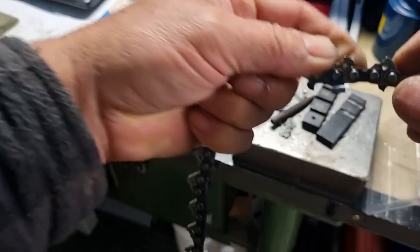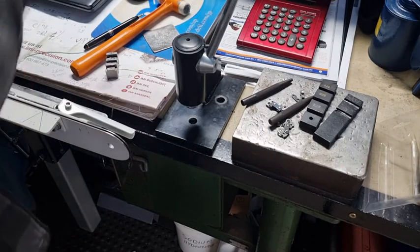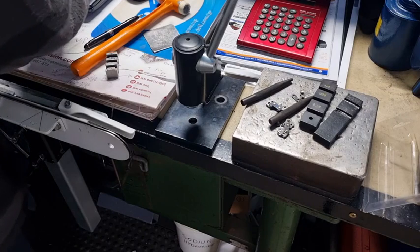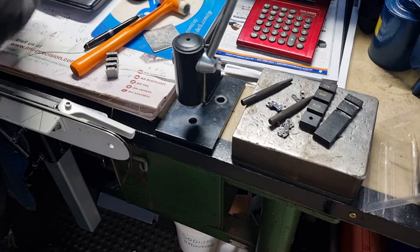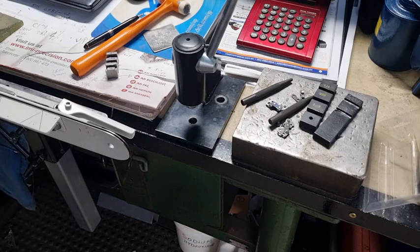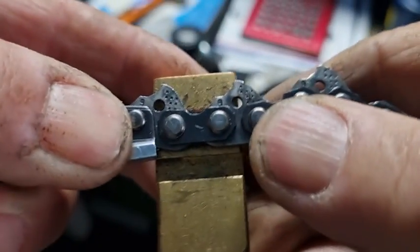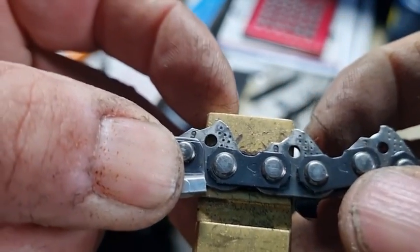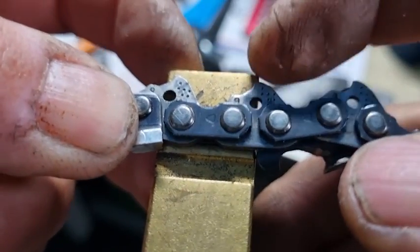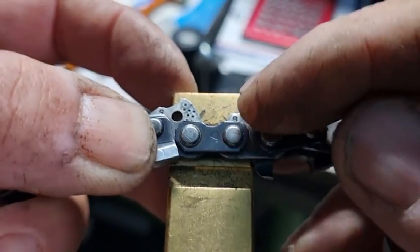The vice goes in between the two drive links. I'll set it up here on the bench to show you where it goes. Okay, I've got it — only took two seconds. When I first got it I made a mistake: you'll notice the two drive links are almost on the corner. I couldn't push that over. You'll notice it's slightly off the edge because of the tooth underneath, but if you tighten it up you get a firm grip and can punch it quite well.